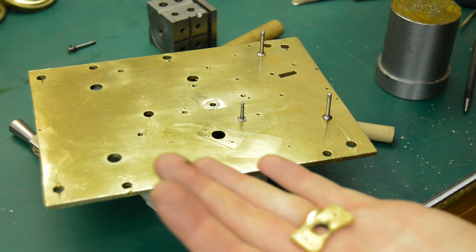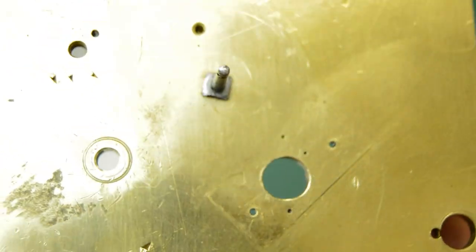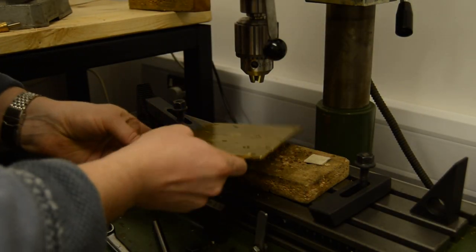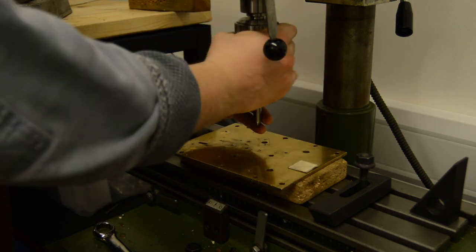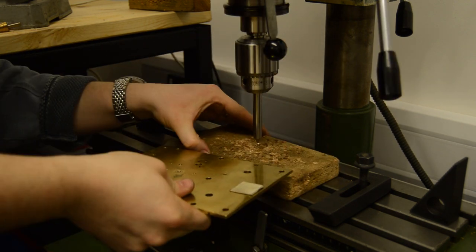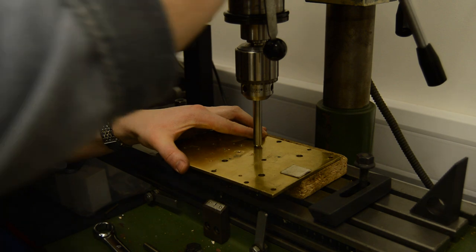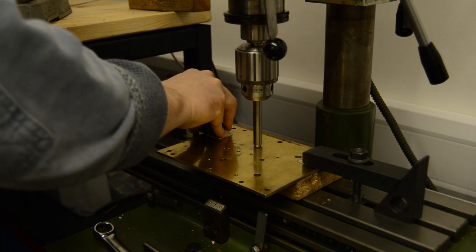With the pins removed I could take the nasty repaired section off and have a look at it. We can see the extent of the wear on the actual bush — this is the original part of the bearing on the plate. We're going to have to plug these holes to get rid of the extra holes that have been drilled and bush the front bearing as we would normally. Back over to the same process of centering in the milling machine; this is by no means the only way of doing it, but it's a way that I've found works for me, particularly on larger bushes like this.